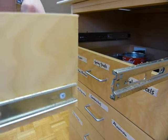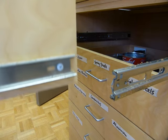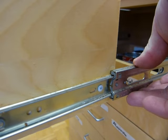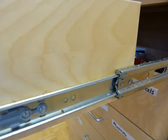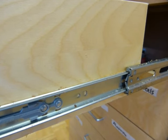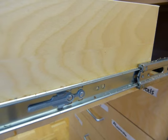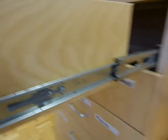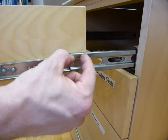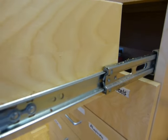Hold the drawer with your hand — it's resting against my knees as you can see. You've got to make sure this portion is lined up on one side, and I'm doing the same on the opposite side — you just can't see it because the drawer is in the way. The drawer is now just barely engaged, barely held on with the drawer slide. The important part is that you're not bulldozing this steel ball assembly in front of itself.